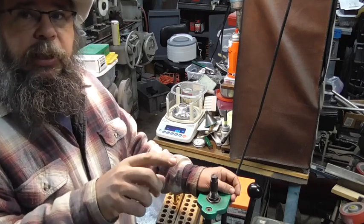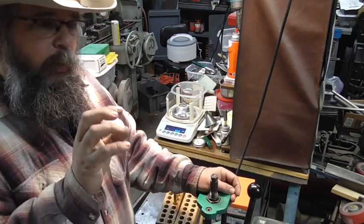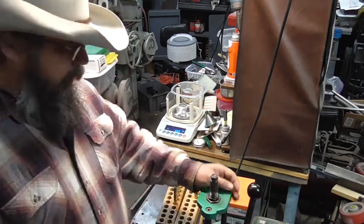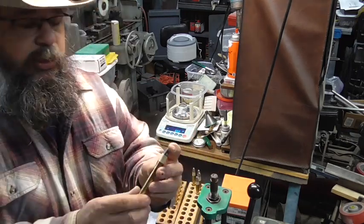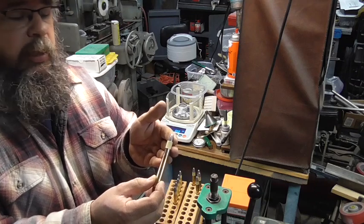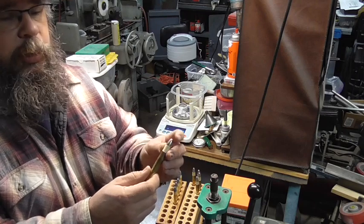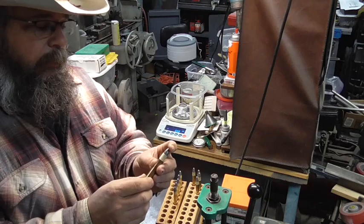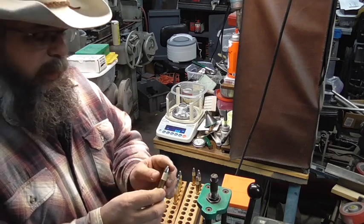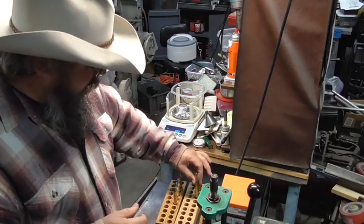That's where we want it, because we don't want any place for that bullet to upset into and then have to shear itself off or swage itself back down to go through the bore. We want as minimal upset on the bullet as possible, as minimal disturbance and distortion of that bullet as possible as it's going through the barrel. Which is really why you do things like this, where that bullet is sticking into the rifled portion of the barrel very deeply, and you just have so much more engagement in the rifling than you do with a grease groove or anything like that, and it really minimizes the upset of the bullet, really reduces the distortion, which is why these bullets, for the time period, were exceptionally accurate and still are.